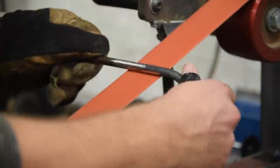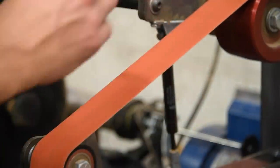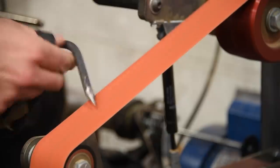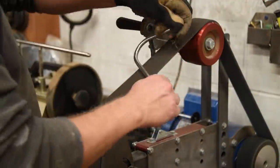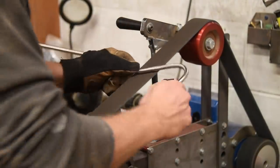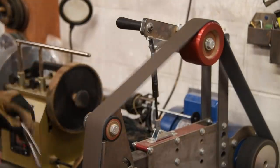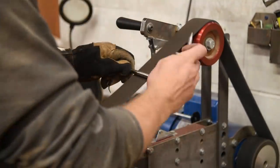Switching to a 120 grit just to shine it up a little bit, take off the forge marks and give it a final sharpen. This belt is a special belt — it's like a Scotch-Brite pad with honing compound mixed into it, so it just kind of polishes and takes off mill scale but doesn't remove a lot of material. It's great for putting a final finish on there.